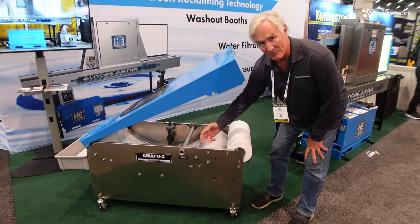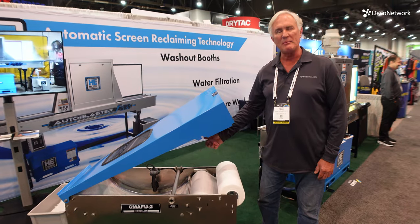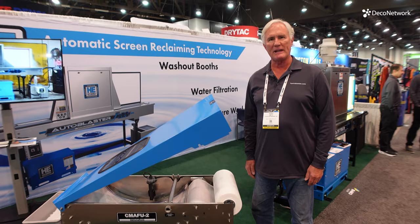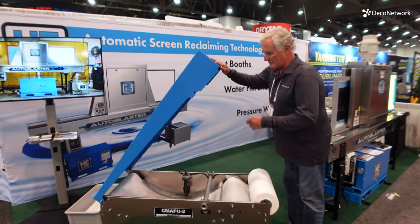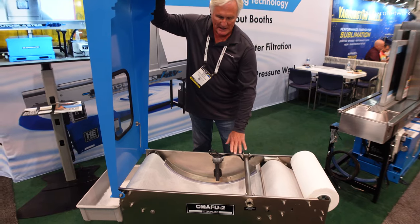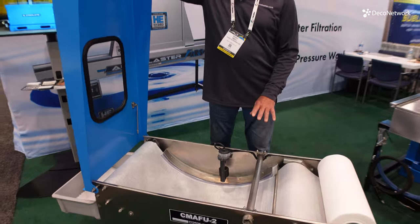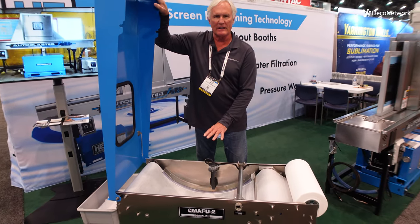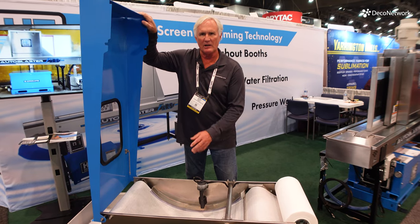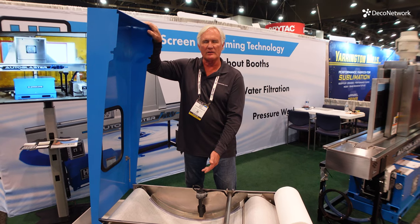This is the inlet of the machine right here. The water comes in through that pipe. There are holes in the bottom of the pipe, and the water drips down onto the paper. The conveyor that the paper is sitting on is shaped like a hammock. As the paper becomes plugged, it creates a puddle on top of the paper. The filtered water drips through, filtering down to five microns.